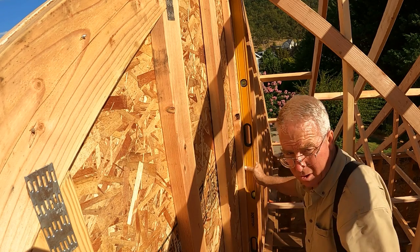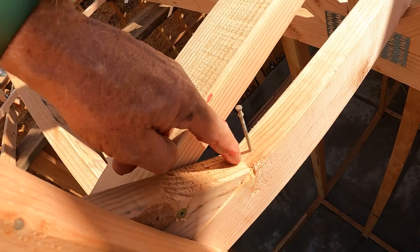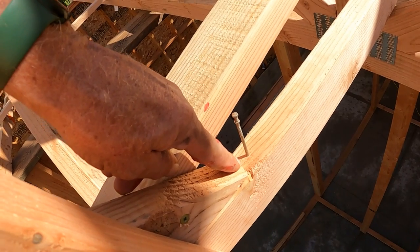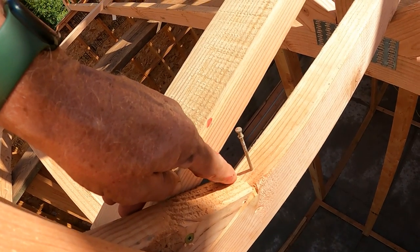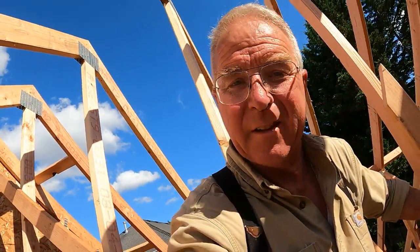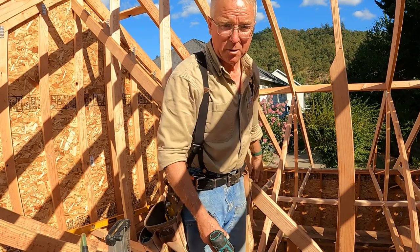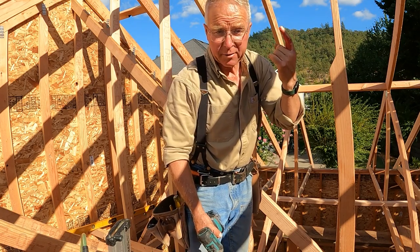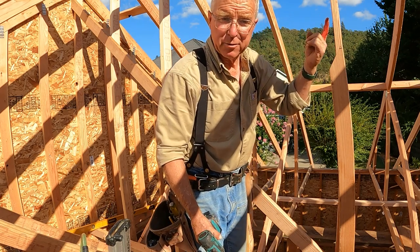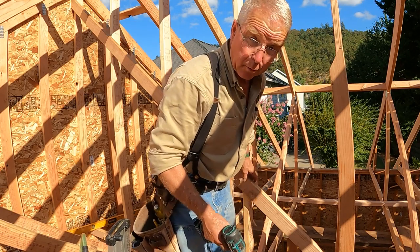That could go another quarter of an inch but I think I may just call it good. We've moved it really five-eighths. If I would have kept at it we would have got every bit of it, but within three-sixteenths to a quarter inch at 26 feet off the ground is every bit of it. I almost made the mistake of nailing these hard — I did nail one of them hard before I got some peak blocks in up there, because these intermediate trusses are standing plus or minus an inch, but I need those peak blocks to be just right. Easy to get the cart before the horse.